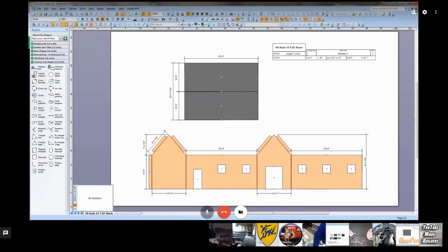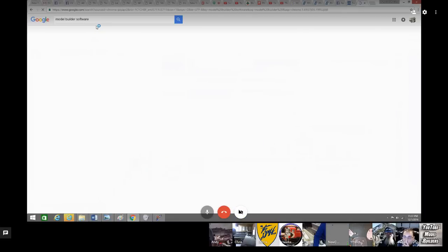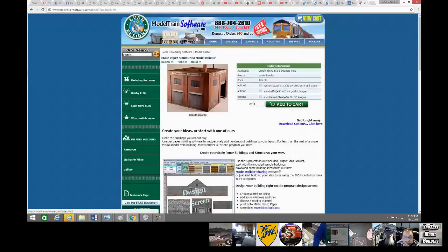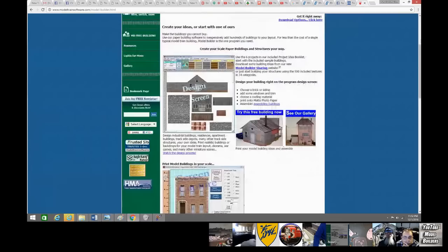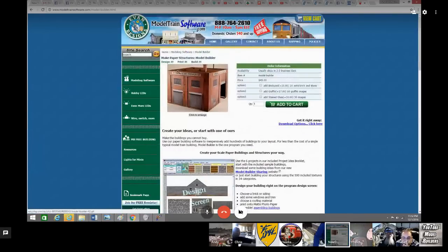All right, so what happens if you guys were talking earlier about 6 being half speed or something like that, and you didn't have it set at 14 volts, you only had it set at 7 volts. What would the train do in that case? It would go slower. Yeah, its top speed is just restricted. Think of it as where your transformer is in front of your control panel. On a DCC system, that transformer is effectively inside the locomotive, and you're telling the knob what to do by sending it a digital control signal over the track.